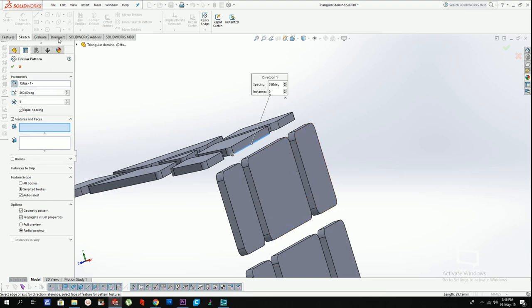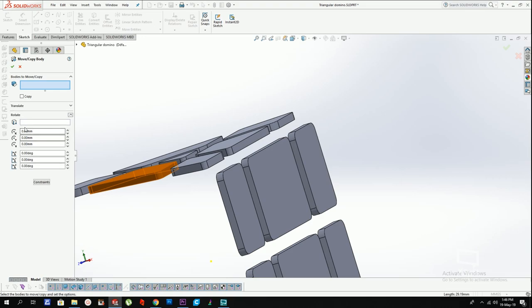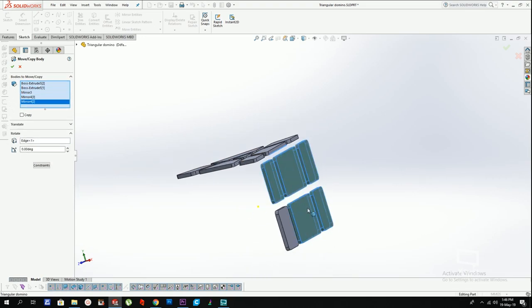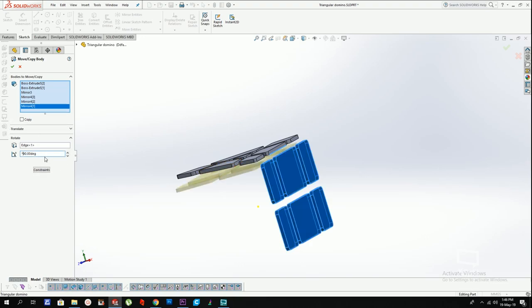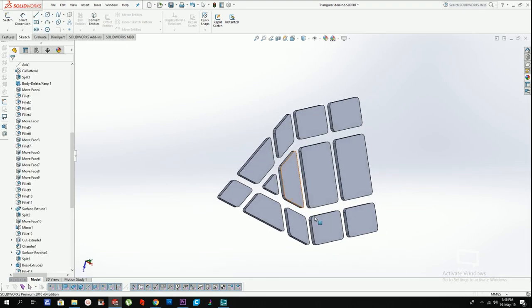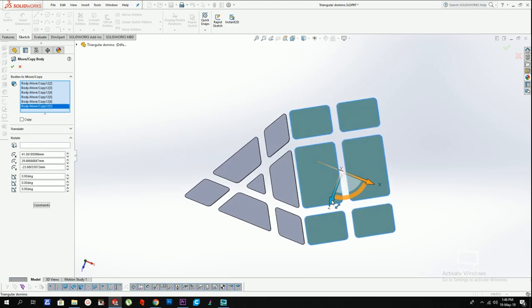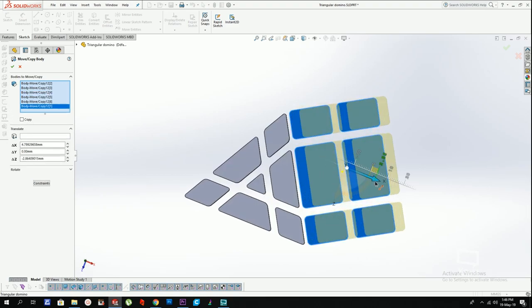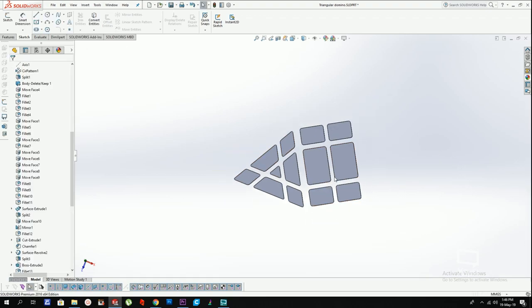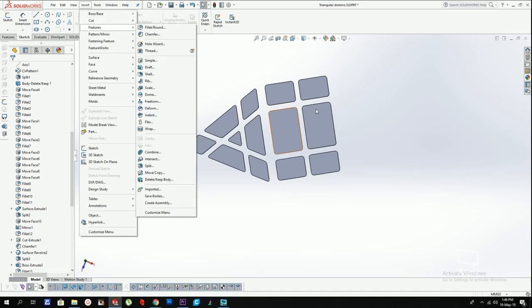These are where the stickers are going to go. I'm adding fillets — for acute angles I'll use 1.5 millimeters because this is a bigger puzzle and it looks better. For the bigger angles, these four, I'm going to use 3mm fillets because they look better. This is what my stickers are going to look like. Now I'm doing this on every single type of sticker — offsetting faces by 0.5, then removing everything that exists and what's left are my sticker sketches. I'm going to extrude those and make them a part.